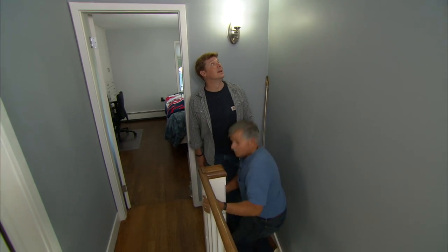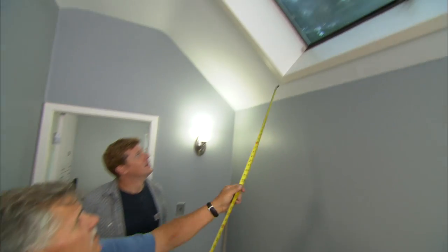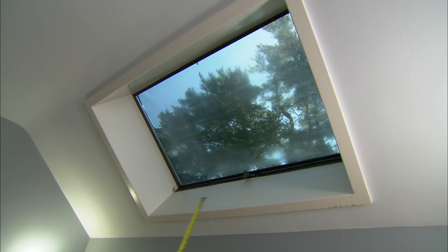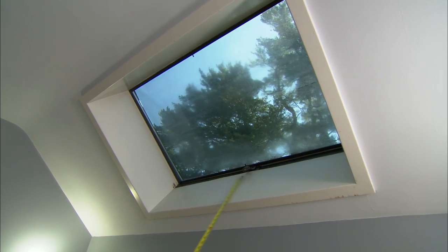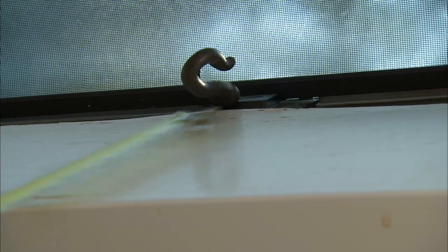Tommy, we're having a few problems with this skylight. It's definitely leaking. I can see the signs right here — this staining, and there's water getting through the trim. Up here on the corners, the paint's peeling, which means water is getting in behind there. Right here in the middle, this piece of wood is all bent and warped from water getting in behind that. Leaks everywhere.